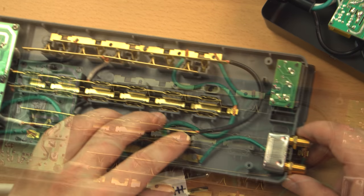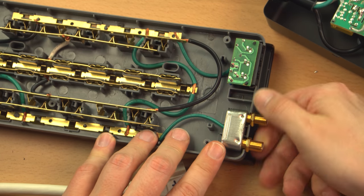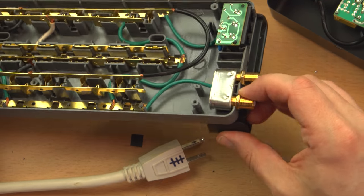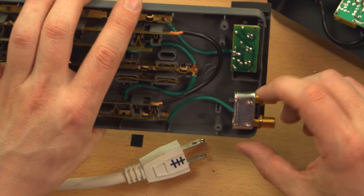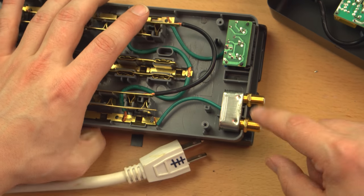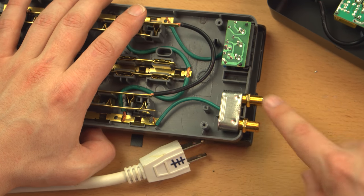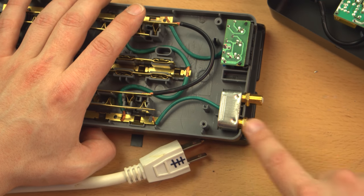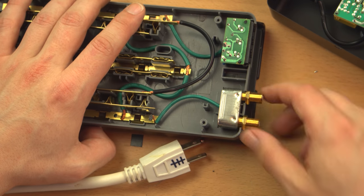This also has coax, which the other one did not, but this one has coax surge suppression, I think. It's obviously a sealed module here. It's this little can. I'm not gonna open that up. And I don't really care, because honestly, who really hooks these up? And if this isn't high enough quality, the kind of frequencies that you need on a modern cable connection for data and for HDTV, this might actually not pass some of those frequencies or cause interference or intermittent connections.